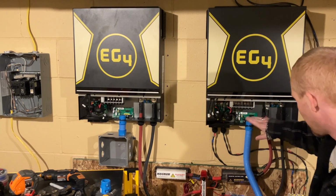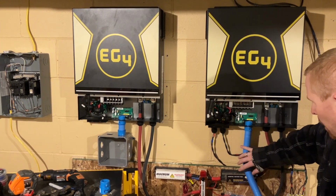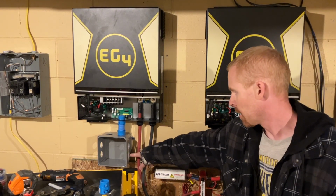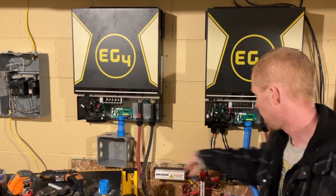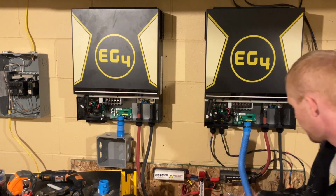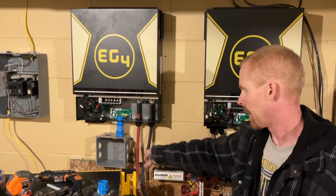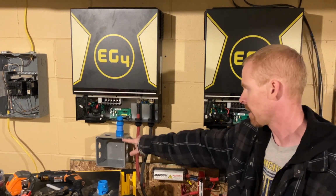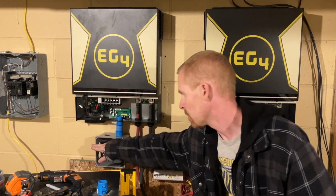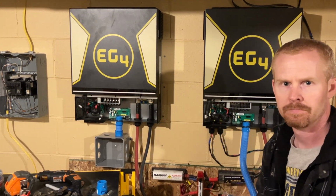All right, I got the wire all pulled back out through. Now I can measure out properly, put my fitting down here, and actually get the proper curve in place. Trim the 1-inch conduit so that it'll come right into here. And then I'll use the other side of the conduit as my out from up above and go over to the panel.